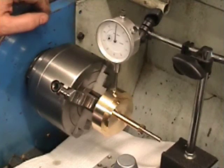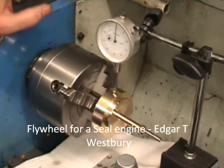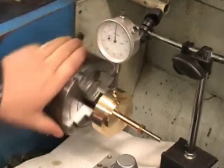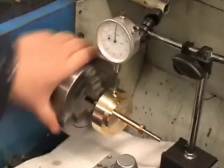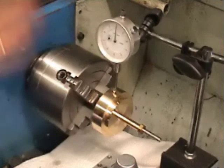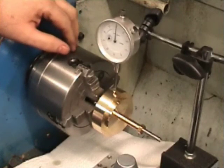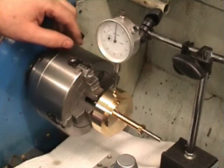Now you've watched the video on how to center a bar using the four jaw chuck, I thought I'd just show you a practical application with this flywheel that I'm turning between centers for Edgar Westbury's four cylinder petrol engine. I had to remove the flywheel to do another particular job and I wasn't worried about putting it back, because with a four jaw chuck it's centered as well as you can. If you look at this, you'll see very little — certainly not detectable — that it's centered on the face I've turned previously. I'm not worried about the fraction that it does move, purely because this isn't to the finished side so there's plenty to go yet. Thanks for watching — if you want to know more about Edgar Westbury's engine and how I'm building it, go to Mike's Models.com where you can see a lot more. Thanks for watching.